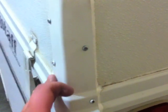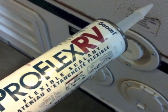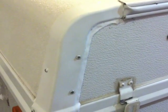It looks much better. Again, when you are putting these screws in, do not over-tighten — that is part of the reason it cracks. But these do just crack from the sun too — they wear and they crack. Also on tent trailers, you want to make sure you caulk all the way across here too with that dicor. Somebody did it right up to a point and then stopped — I kept going all the way across. What you use on the sides of the trailer instead of dicor — you only want to use the dicor on the roof — you use ProFlex to go around areas like this. That completes this video on how to change out corner caps on a tent trailer RV.